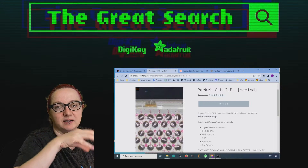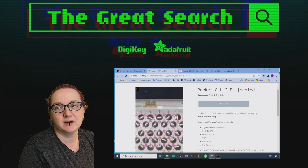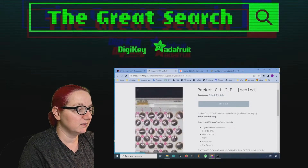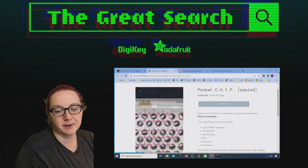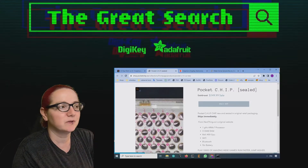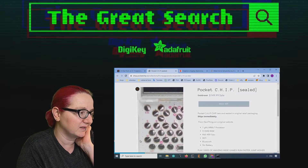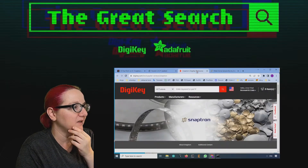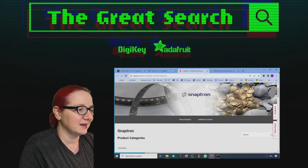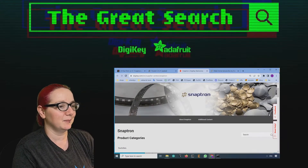This is a much less expensive way of manufacturing and has a much lower height — you don't have the mechanics of a switch with pads and an actuator above it. Your finger is the actuator. You can put a vinyl overlay with legend on it to label the buttons. I have these low-cost remote controls, and when I was a kid I had a pocket calculator with dome switches. SnapTron's whole thing is they make dome switches. Really big ones, teeny ones — they come on tape so you can pick and place them very easily.